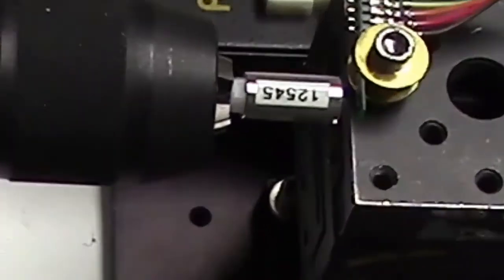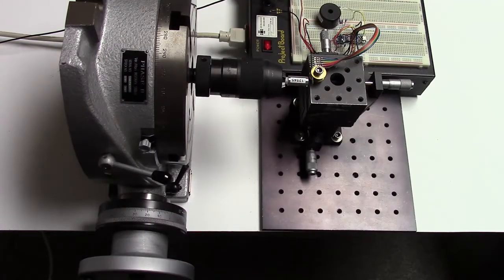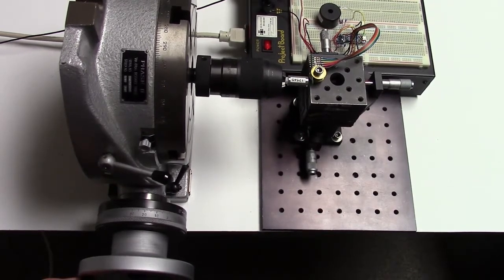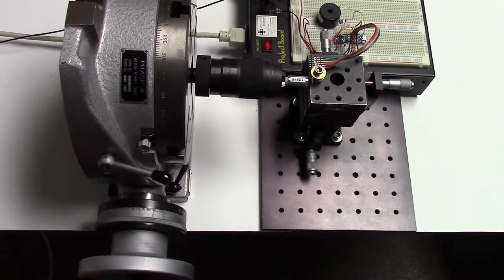AAT sensors are typically paired with inexpensive diametrically magnetized magnets. The red LED and beeper indicate virtual encoder lines. A hand crank revolution is four degrees, so the resolution is half a degree.